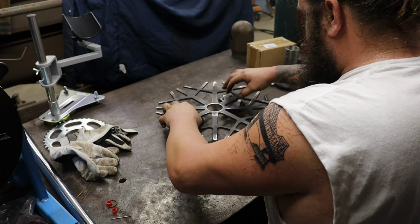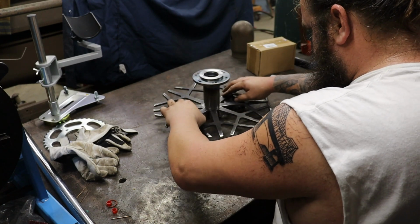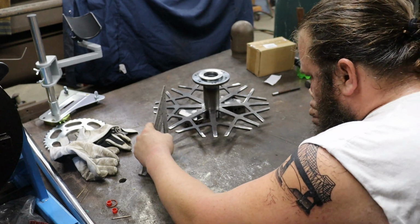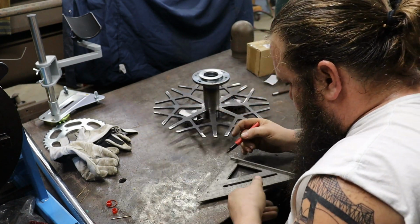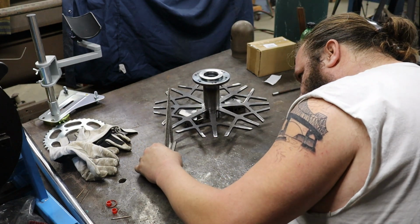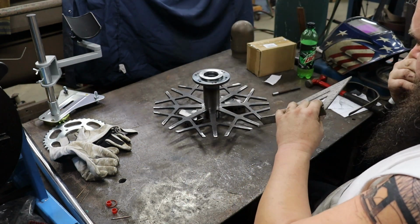Once we did that, it was time to start setting up our center offset. Based on a stock wheel for the bike we're going to be running, I know that we wanted the face of the mounting sprocket flange to the center of the rim to be 4.5 inches. So keeping that in mind, we took our 1-2-3 blocks, added a piece of 1/4 inch steel on top of each one for a 1 1/4 inch offset, which is just how everything calculated out.